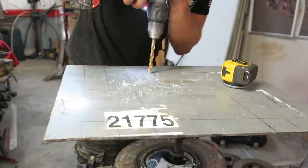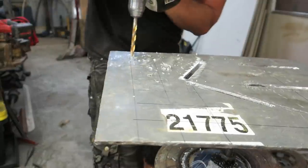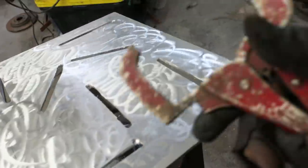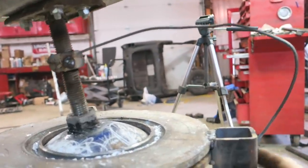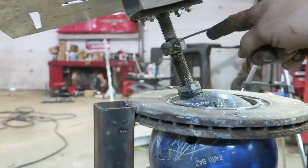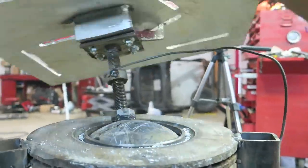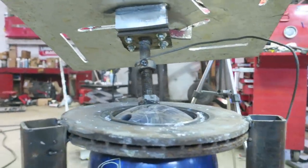The best way to cut aluminum is just a wood bit in either a jigsaw or a Sawzall. I just drilled a half-inch hole in there on either end, a double on one side so I could get my blade in and cut it. No matter where I put my vice grips now I can reach part of the table. For the grounding, I just took a piece of electric fence wire and welded it to the post and to the nut — I can spin that. Electric fencing is heavy enough that it'll turn the nut so I won't be walking the nut up on top. And I have my ground.